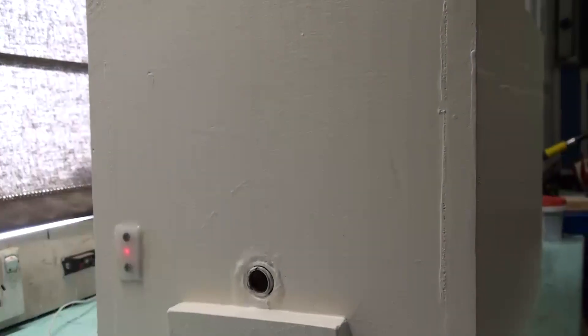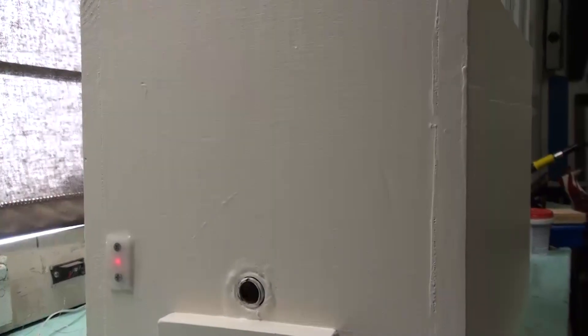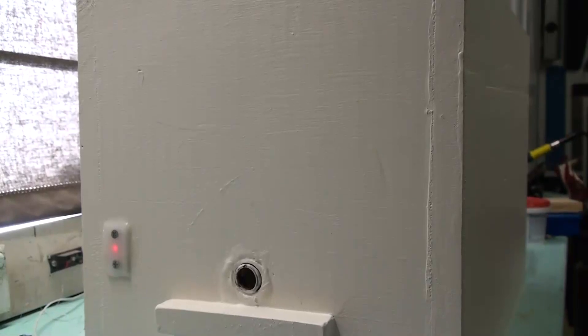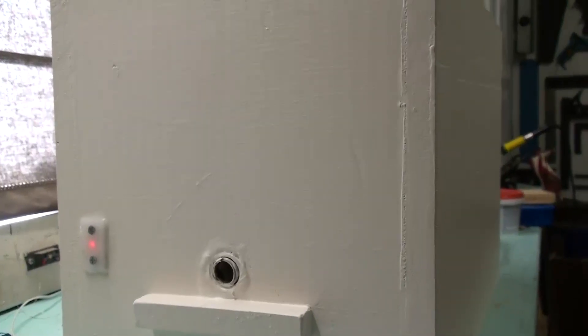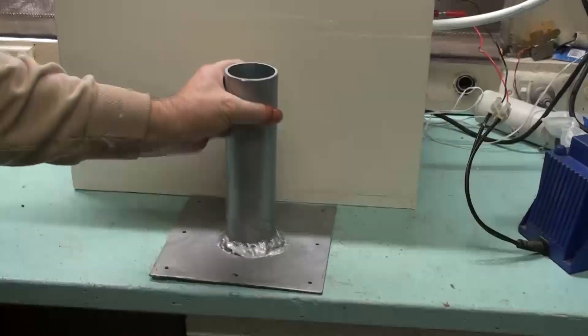I made a slight change — I cut some foam out around the hive to allow a little room for air circulation, leaving about a centimetre of clearance all the way around. On the front of the hive I've mounted an LED behind some white perspex so I can tell from the outside whether the heater is on. I need to monitor it and may have to adjust the wire length since I haven't done this before. I've also welded up a mounting plate — and as a welder, I make a very good train driver.